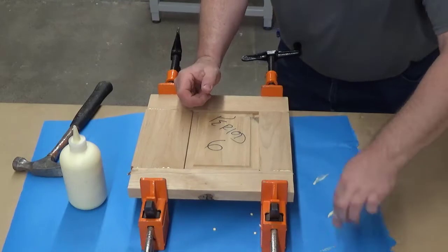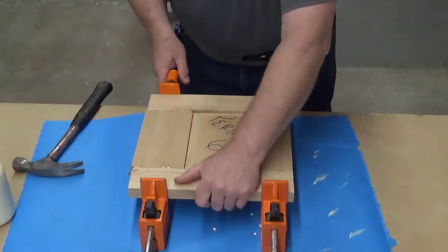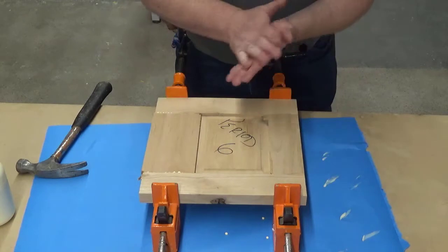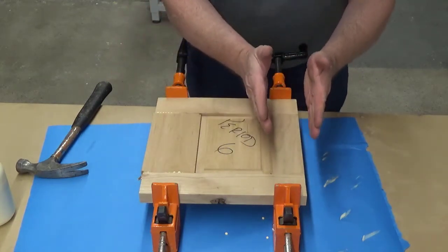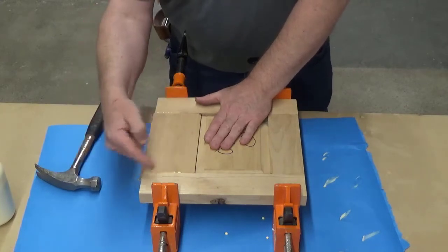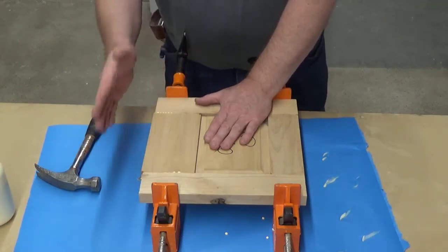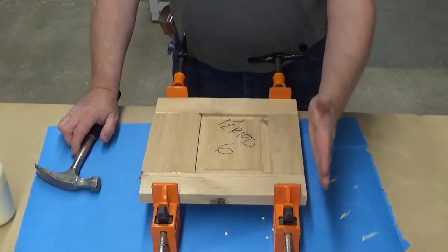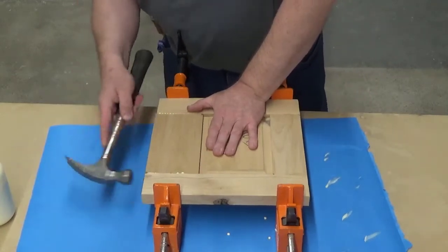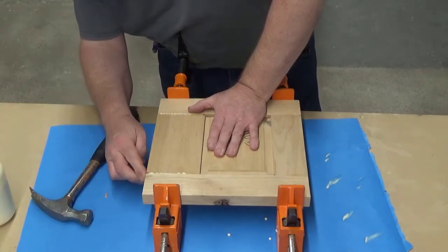I'm going to take all the glue off the surface of the panel including the ends. I'm working from the top to the bottom. I always set this one first — this always has to be flush. Now in the event that you have cut either your top rail, your panel, or your bottom rail just a little bit narrow, sometimes you have to move this up a little bit so it looks like the stiles are just a little bit long. If that's the case it's not the end of the world, just as long as the top edge is flush with the top end of the stile. My sizes are just fine so I'm going to tap this in and make it flush.